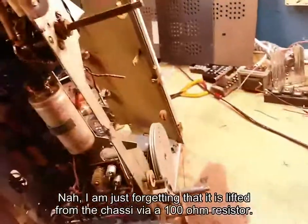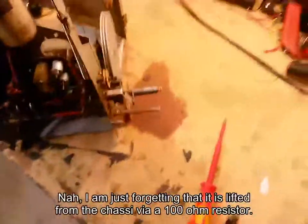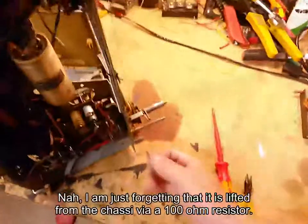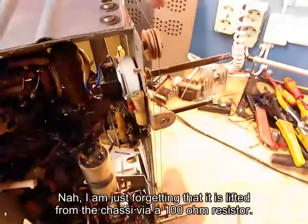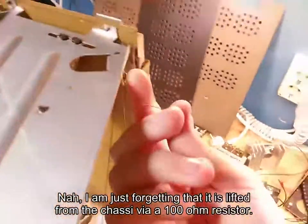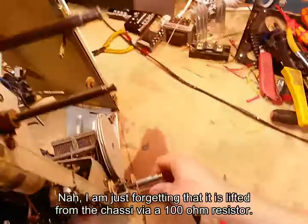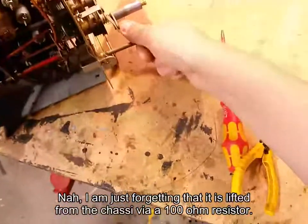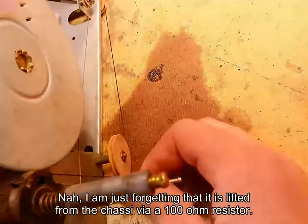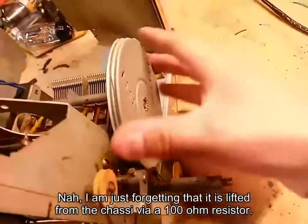And yeah, we have a broken dial wire here, which goes from this, which is actually that selector I was messing with earlier, which didn't do anything. So that's supposed to go somewhere and do something, but I'm not sure what exactly. It's supposed to go here on this, over into this tube here, and then it goes inside here. It looks like this part of the dial works, although it's slipping down here because the thread is just worn right out, so it slips. And also this is going really badly, so we have a bit of sorting out to do here.